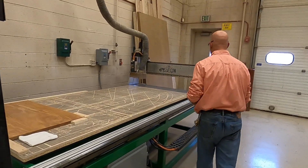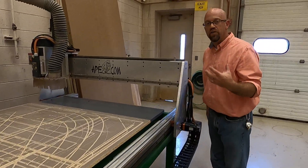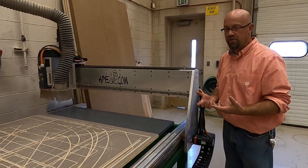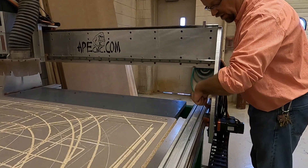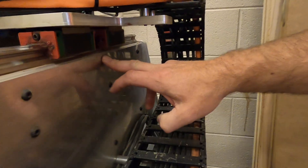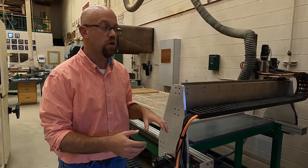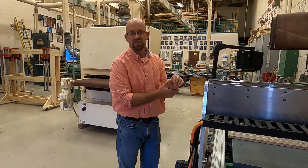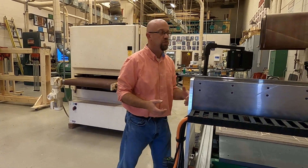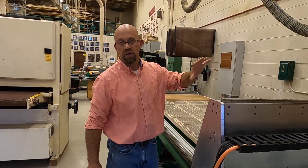A few things I'd like to talk about are the linear bearings and the grease fittings. On each one of these linear bearings I have a grease fitting, and they were just done. I have some more on here and here, some on the back, and other parts of the machine. I'll go through these individually with you the very first time you clean or prep the machine. We don't have to grease the bearings every single time — I'd say about once a month given the amount of time this machine is running. All the grease fittings have been hit.